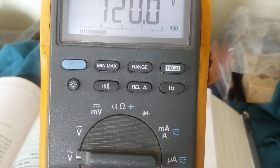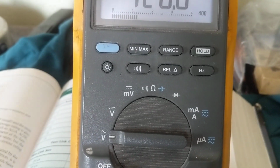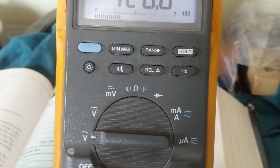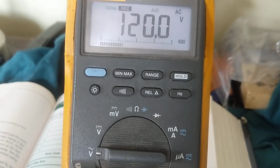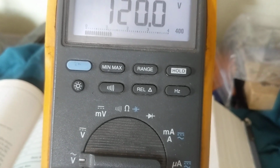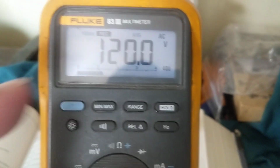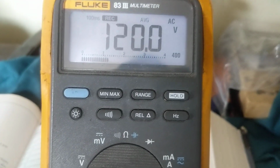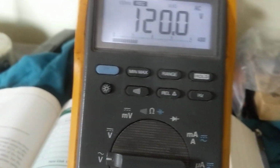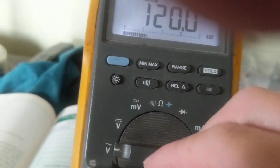And is the alternator working? It's going to go right back up to 14 volts or 13.5 volts, or if it has a temperature compensator, might be higher in the winter than that voltage. It doesn't matter. So the range will be 12.6, 10 volts, back to 14. What's the maximum value that I should see here? 14. What's the minimum? 10, 10.6. Therefore, this function to me is very, very important. Let's go again.